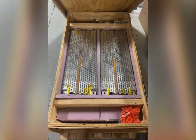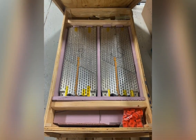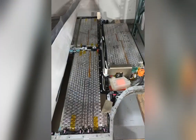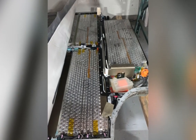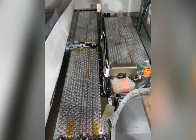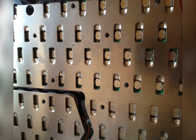And a lot more amperage than the older packs — it can put out over 1,700 amps for a short time. Here they are all boxed up, individual modules. Each module is about 24 volts. It's a 6S86P for the battery geeks. Add them all up and you have 8,256 individual lithium-ion cells.